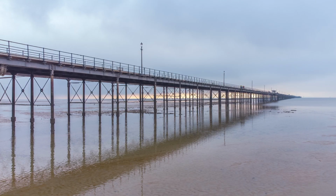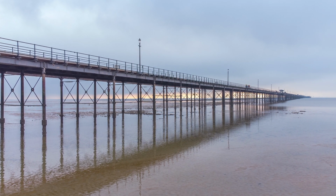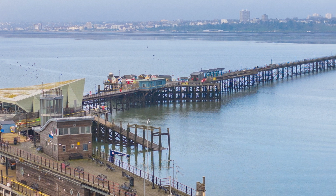One of the inherent problems of working on a pier is the tidal conditions and very harsh environmental conditions. We looked at various options, paint finishes and so forth, or just leaving the steel as bare metal. We realised that because the corrosive atmosphere is so inherently difficult to protect against, galvanising was the obvious choice to protect the pier for the future. The structure does corrode very easily, being in a salt environment, and galvanising is definitely the best bespoke material to use to give longevity to the beams.